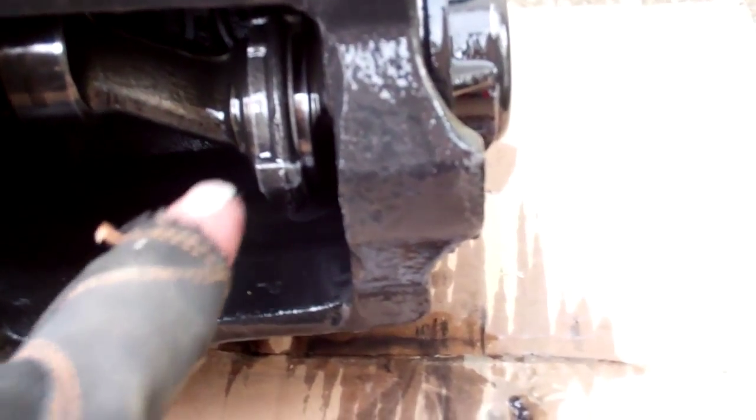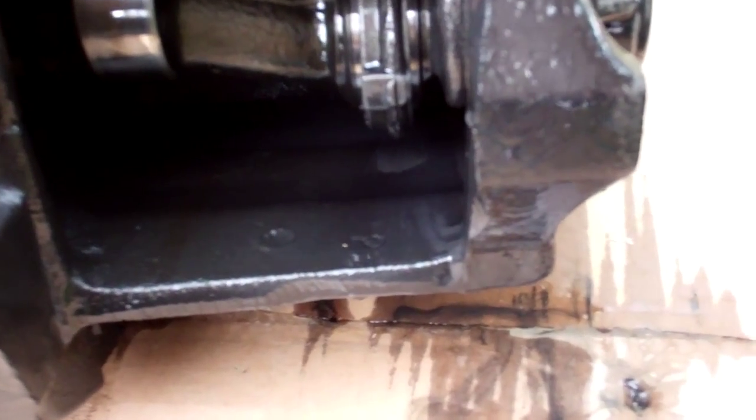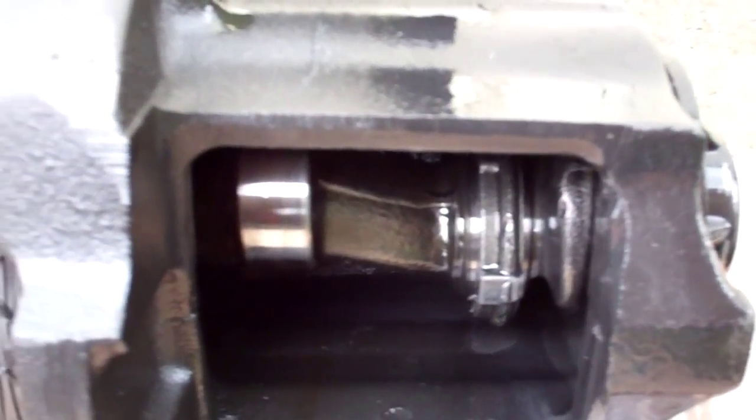The windings themselves don't look too bad. Where they look dark is actually aluminium dust that's in the oil from where that rod smashed up, so this must have run noisy for quite a while. It actually rotates — we'll see how much more we can get took apart.